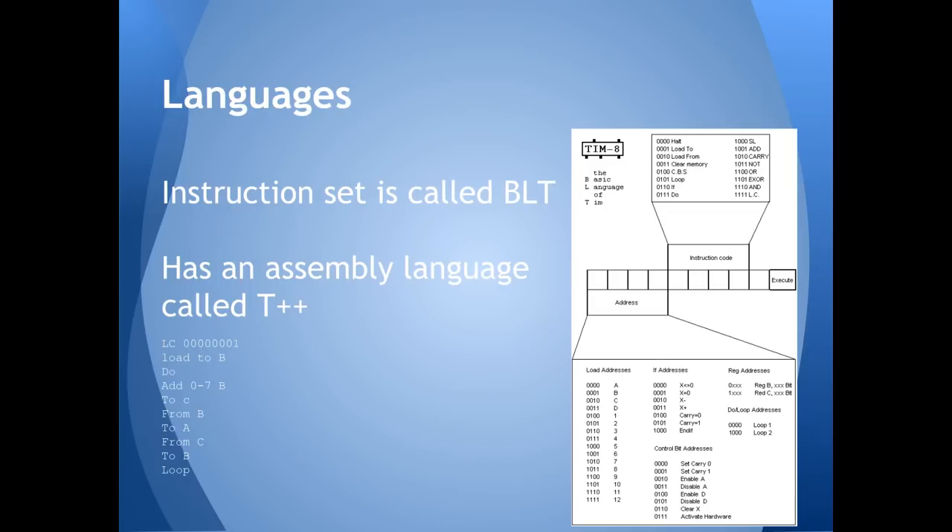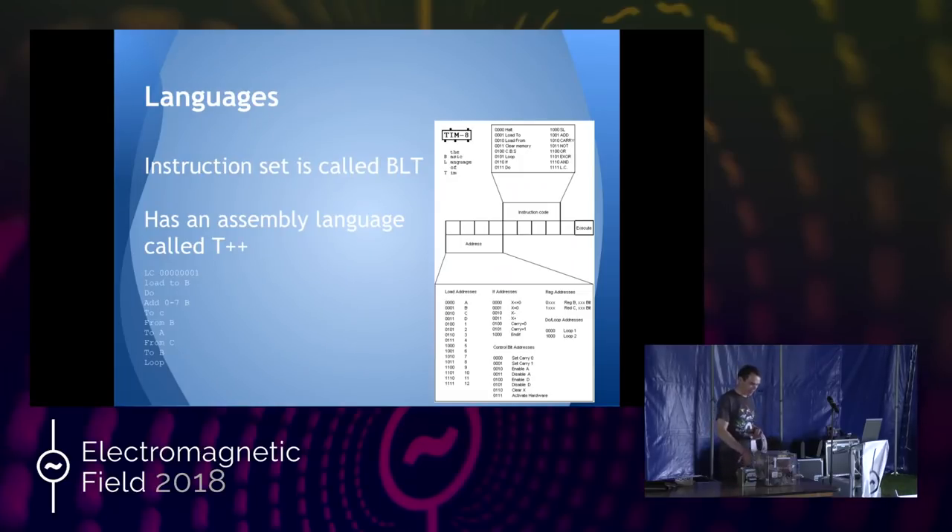These days I know a bit more about electronics having done my degree in electronics and many more years doing it after this. I know a bit better about protocols — a parallel port is about the simplest possible protocol you can use. So I stuck a parallel port on it, wired that in, and it can now print with the tape reader. I plugged it into the same tape reader it uses for input. The text is very small because the default font is quite tiny, but technically I can plug this into any printer and it'll print out — you can use it like a teletype terminal.